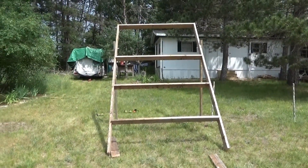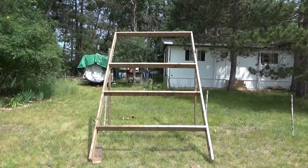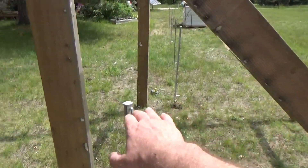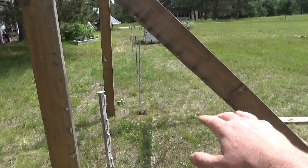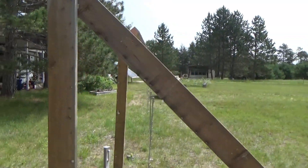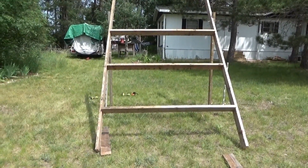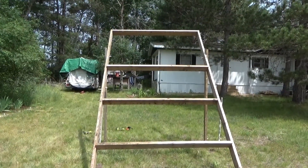There's one rack — it's huge. It's on a slope though; the whole ground is sloped here, which is not optimum. I'm going to have an arm going across with pins in it, just like the main panels for the house, so it will be adjustable for the seasons with the hinge point up top. Once I get cross bracing in to stop the side-to-side wobble, I can start putting solar panels up. I'll start with two and use this as a testing station to see what panels produce what power.